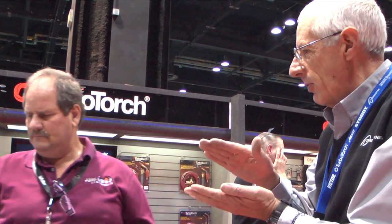Aluminum is coming out in everything now. If you don't know how to solder aluminum, you're not going to make any money — and that's one of the reasons I'm at the shop. That was so much easier than I thought. As for doing aluminum to aluminum, I wouldn't suggest it. You'd want to use regular paste flux for that, because the flux temperature is going to be higher and it takes a little bit longer. This process is fast — you saw how fast it is.